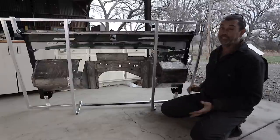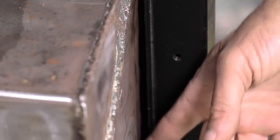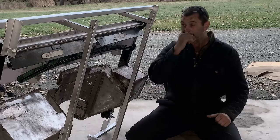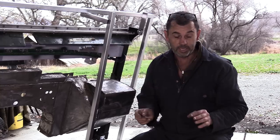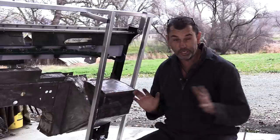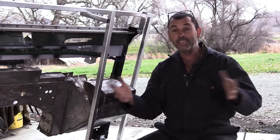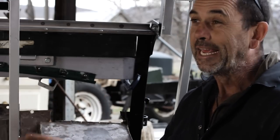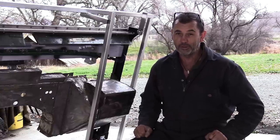We can see that we've got things in the jig and it's lining up a lot better than it was on the truck, especially around the back at the passenger side, but we still got that big quarter-inch gap that occurs here alongside the foot wells to the door pillar post. The other side's flush and lining up a lot better than I thought. Now, something to keep in mind is our vents — with the hinges on they touch and it stops the vents from going in, so there'll be some minor adjustments to make sure they clear. As far as the foot wells go, there's a lot of boring dreary work that can be done behind the scenes. The next episode is where we hope all the panels come together, all the welding is perfect, and then Bob's your uncle — we have ourselves a bulkhead. So if all goes well, you can join me in the next episode called The Big Stitch Up.